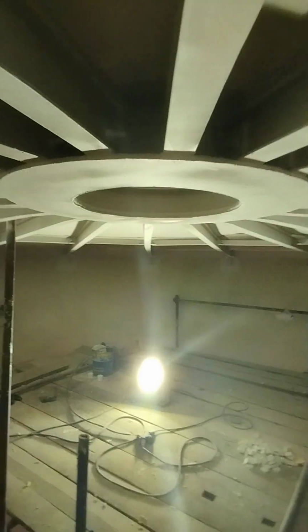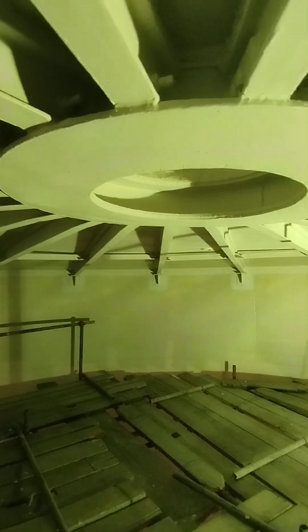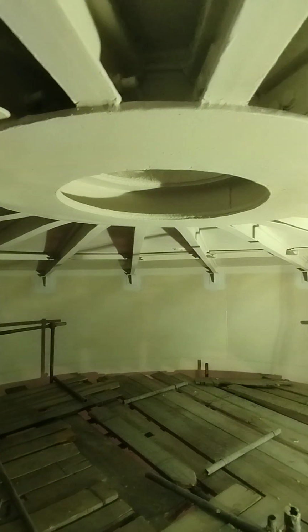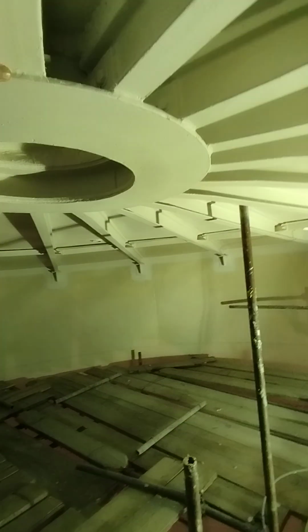There is also one choice here: if you are going to use carbon steel in these kinds of storage tanks, you have to take care that all the parts that have the capability of meeting the water are completely protected or covered with paint and all other protective layers.